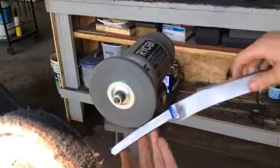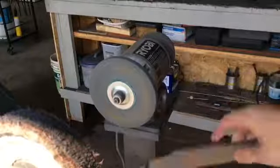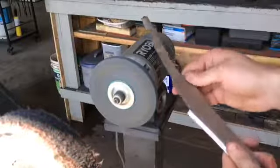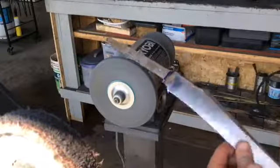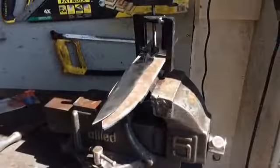So you can see how I have it polished up right there, and it's good to just start sanding horizontally so that I can get it all polished up. So I'm going to do the same to the other side, and then I'll run the Scotch-Brite wheel on some more places that are kind of hard to polish. So the ricasso here and the clip point, I'll just polish them up a little bit on here before I go to the hand sanding and hand sand everything.